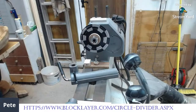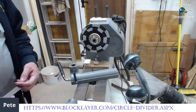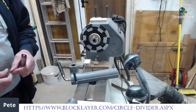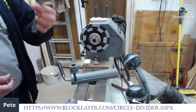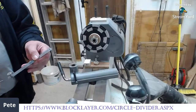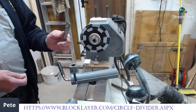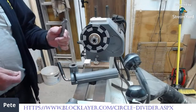The reason I cheated and glued this block on the end is I was looking for something with a bit of spring in it. I considered using an elastic band on a piece of wood, but then I thought I could use a ruler. I've got several, so I pinched one of my six-inch steel rules and put a bolt through the end, which will go into the indexing disc.